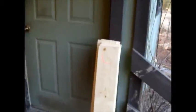So I have 7 long boards and 7 short boards now. And these short ones, the 35-inch side, I'm going to take one of these and cut into a diagonal. So I'll just select one that looks the nicest and use that since it'll be on top. I have a piece here that has a few knots in it, but at least from here to the other corner, I don't have any knots on that line. So I'm just going to take a straight edge, such as one of my other boards, and try to line that up. And we'll cut the short one at a diagonal.